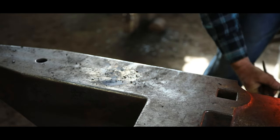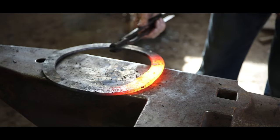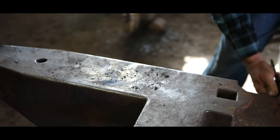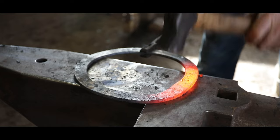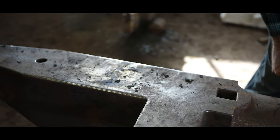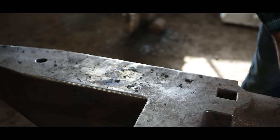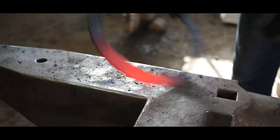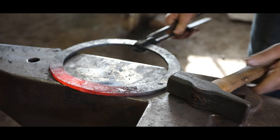Once you get it welded, you want to get it back down to the quarter inch thickness in that weld area. Hopefully you haven't made it a lot thinner on either side of the weld. And then start truing up that curve. It's probably going to take you two or three rings to get it exactly right. Like most of these projects, you do the math, try to get halfway close, and then you figure out what you need to adjust to make it right next time.